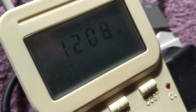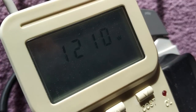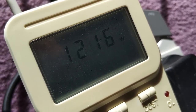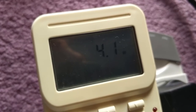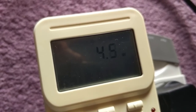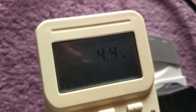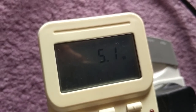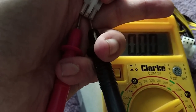When mining, the D3 is consuming 1200 watts, which means my 1000 watt power supply mode isn't really that great — I need to quickly buy some better power supplies. One of the Bitmain power supplies is dead; I'm getting between 4 and 5 watts. The fan is spinning on the power supply but the Ant Miner is not powering up. I've replaced the power supply and the Ant Miner powers up, confirming there's a fault on the power supply. Measuring it, I get zero volts instead of 12 volts.